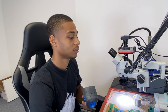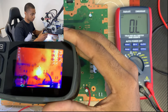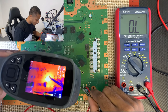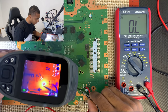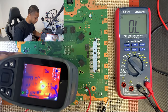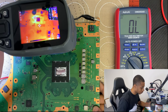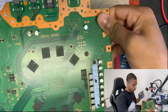I just turned my DC power supply on and we want to see what's heating up. Whatever this area right here is — it's heating up, getting to about 51 degrees. This could be something on the other side of the board too. The max on this side is 36 degrees, which is not as hot as the other side — so I know that the short is from one of these components on the hotter side of the board.